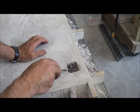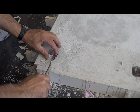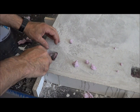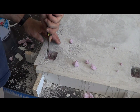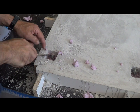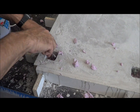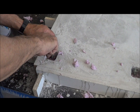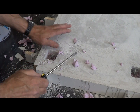Here's the pocket with the tendon exposed — I just dug the styrofoam out. Take a screwdriver and get enough of the foam out so you can get to the tendon. I put pockets on both ends of this piece; you only really need one end. The reason I put pockets on both ends is I want to see where it fails when we push this piece to failure. My guess is that since these are grade 30 steel, the threads will probably strip — either it'll fail in shear or the threads will strip and pull out. The rod probably will not break. We'll tension them a little before we strip it, then start pushing it to failure.